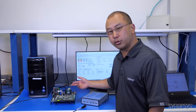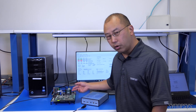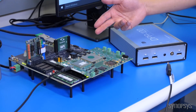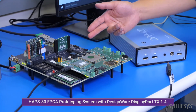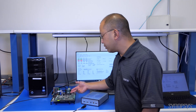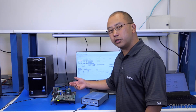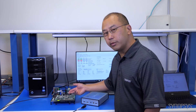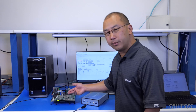I'm excited to show you our certified DisplayPort 1.4 solution. We've implemented the solution on the HAPS DX platform — specifically, we've taken the DisplayPort 1.4 transmit controller and HDCP 2.2 embedded security module and implemented it in the FPGA on the HAPS platform. That is connected to a PHY board, which has a FinFET PHY supporting USB 3.1 and DisplayPort 1.4 transmit in a single combo PHY with Type-C support.